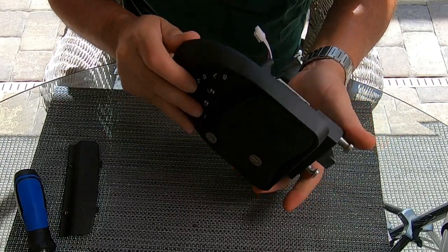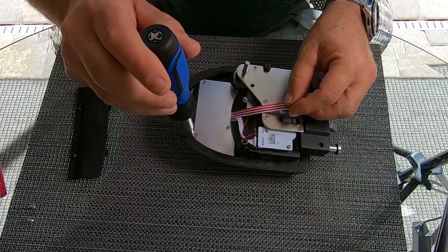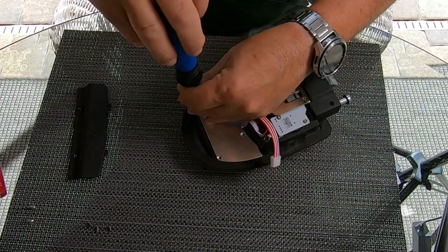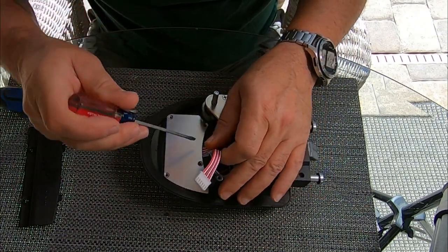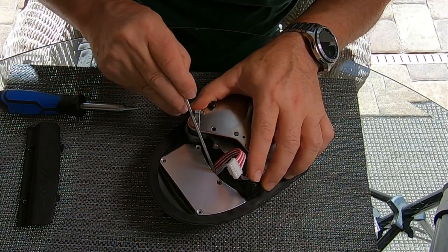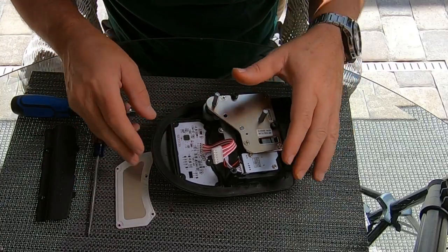The second part is the KPD board on the main outside unit. It's upside down here and has four screws holding it in, right behind this metal panel. Remove those screws, then come in and pry open that little metal plate — it kind of sticks in there. The plate comes off and you can see it has a foam gasket to keep it protected from water.